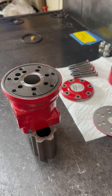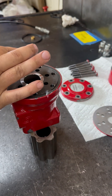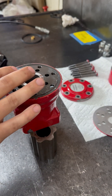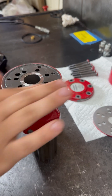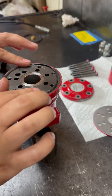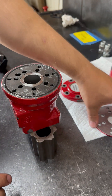Next we're going to get some grease and put that O-ring in there. I don't really do a lot of Danfoss motors, so I've got to read the instructions quite carefully. I mostly do Eatons, Whites, Parkers — I don't really fix Parkers very much, those parts are just so expensive. So this is the grease. Put it on the O-ring — that's part of the seal kit. I'm using a full synthetic grease that doesn't have any additives in it, just kind of wipe it all around.